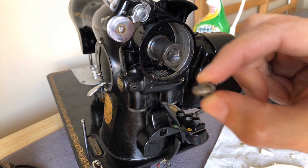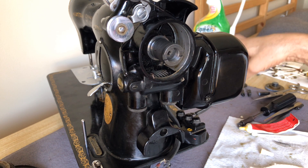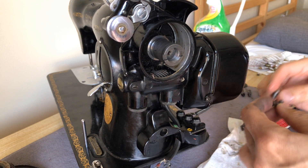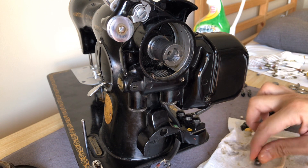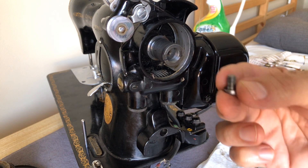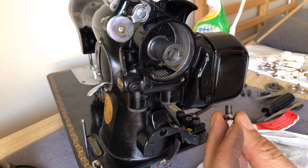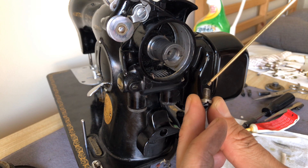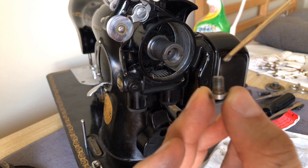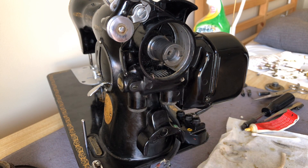I am going to clean, in my little alcohol bath, these two screws. I really would like them to be nice and clean when they go into these holes here — just dip them in very briefly. They might have a little bit of old grease on them. I'm going to put one drop of sewing oil on the end of each bolt. It's going to work its way down the threads — one drop is all you need. And as I put the screws in, it will feed all the way into the threaded holes and you're good.